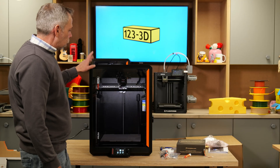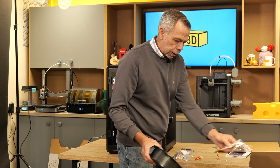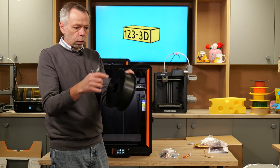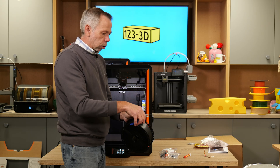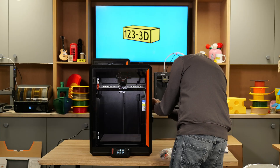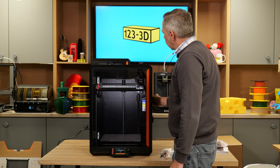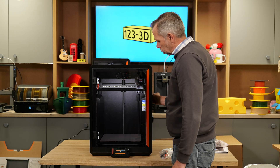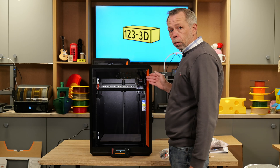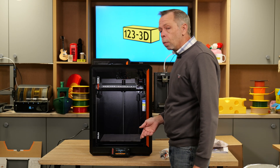That's it, we're there. I'll have a look at what filament we have — the obligatory galaxy black. Can't beat galaxy black. Remove the silica beads. As you can see on the end of the filament, it's a little bit wavy where it's been clipped into the packaging. Take your side cutters and clip it off at a 45-degree angle. I'll pop that on the spool holder and feed it into the tube. It's already acknowledged something — there's a filament sensor located in that part. We'll feed it through until we feel resistance. It has now picked it up and is asking me what material type it is, so I shall select PLA. It'll heat the hot end to the right temperature for PLA and then extrude a little bit, and it'll ask me to confirm that filament has come through.